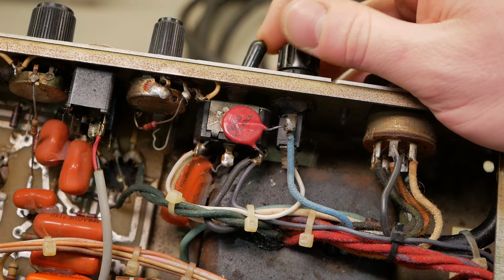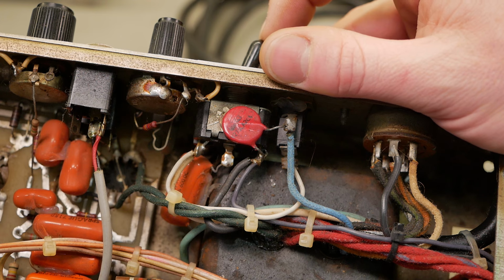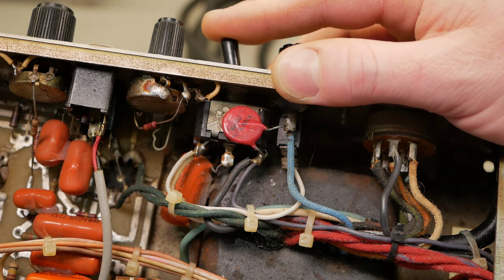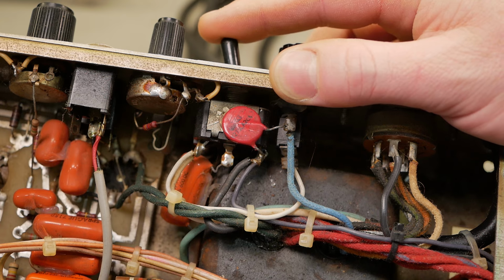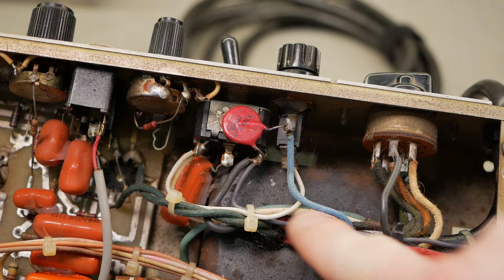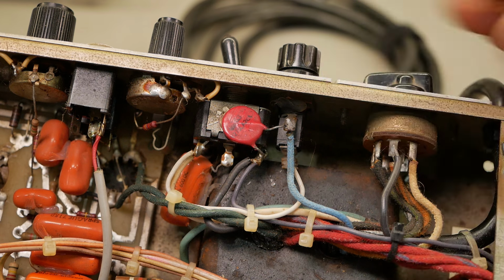So if you flicked it that way, it'll tie the neutral to ground, you'd probably get earth leakage and it would cut out on your earth leakage detector. If you click it that way, it goes from active, hard short to ground. Now, that's assuming that all your wiring in your house, your cord, your plug and everything's good, and your ground connection in here is good. If one of those isn't, what you'll have then is an energized chassis at 240 volts, so a death machine. And what's that chassis connected to? It's connected to your guitar hardware via the guitar cord.